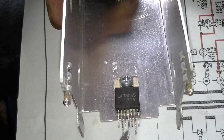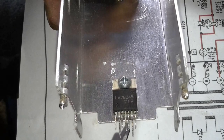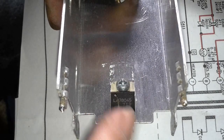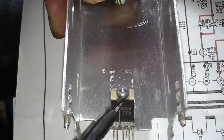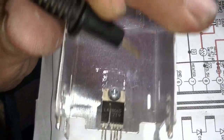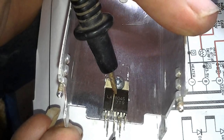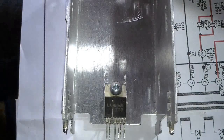We skip pin 4 because pin 4 is the casing. Now let's go to pin 5: nothing. Pin 6: also nothing. Pin 7: also nothing. Now let's go back. The pin that is shorted — pin 3 — is shorted. Now let's put the red probe directly on pin 4 and the black directly on pin 3. Look: short between pin 3 and pin 4! Understood? Pins 3 and 4 are shorted. Let's look at the schematic to see who is pin 3 and who is pin 4.